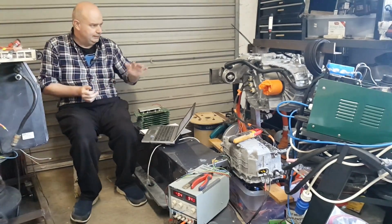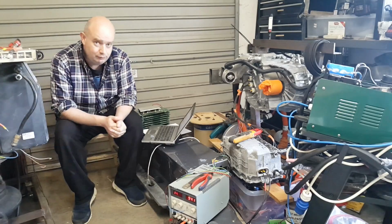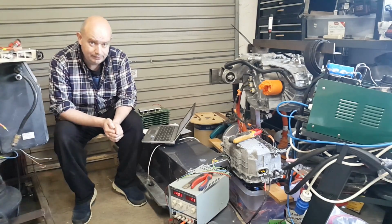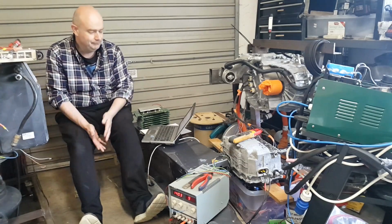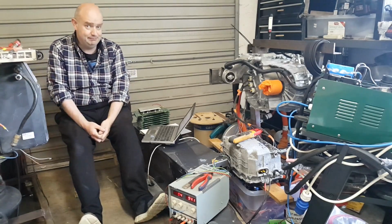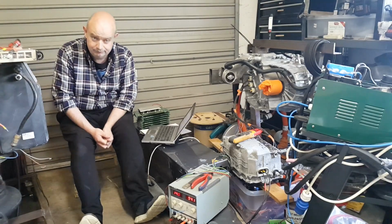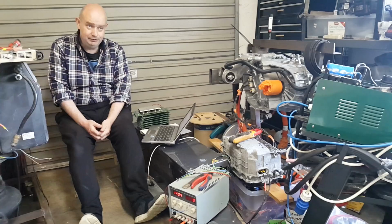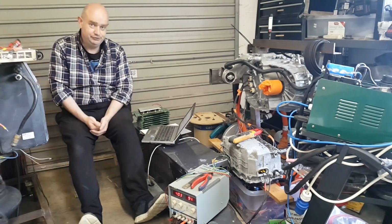Alright, now, how we are running or trying and failing to run the motor today is with the new field orientated control firmware that Johannes has just made available for the open inverter system. Now, I've never used it before until literally, I guess, yesterday. And it was as well that I was using the Prius inverter with anti-explosion technology because the first time that I turned the thing on, it tried to go to infinite current. Of course, the Toyota engineers had already, I guess, figured out that a muppet like me would probably do something like that, and it just went click. Whereas the Tesla inverter would have went boom. So, there we go.